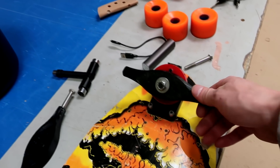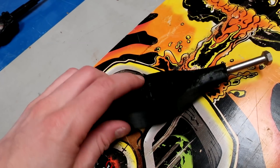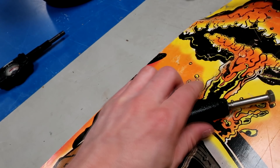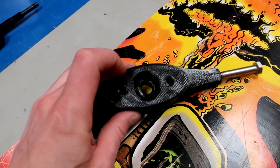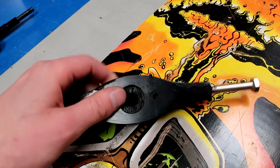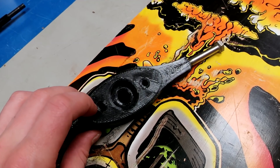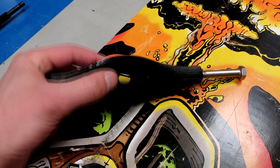I've decided to make these and see what they feel like and try them out. This is the first version of the hanger I made — it's basically identical to the one I've got on there, except it's missing a hole for the axle on the other side. I messed up when making the model and forgot to mirror the hole. For the bearing surface, it's not very clean or smooth, but that doesn't matter because I'm registering the bearings on the inner cylinder of this hole on both sides. That's a real snug fit, and it's registering mostly on the sides.